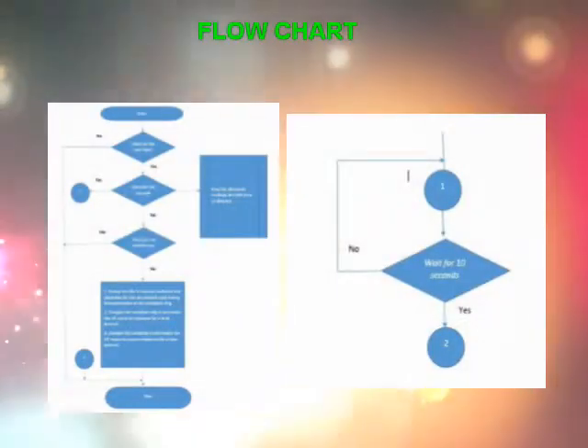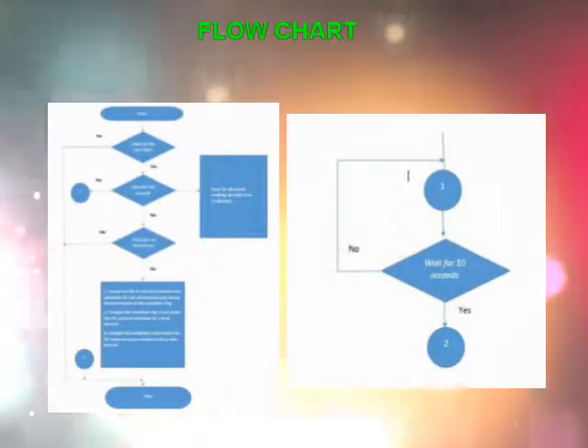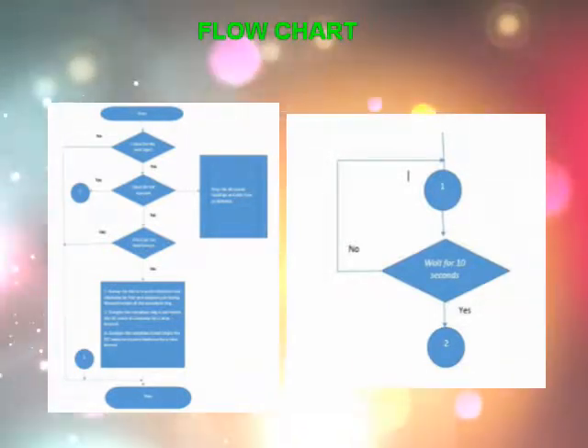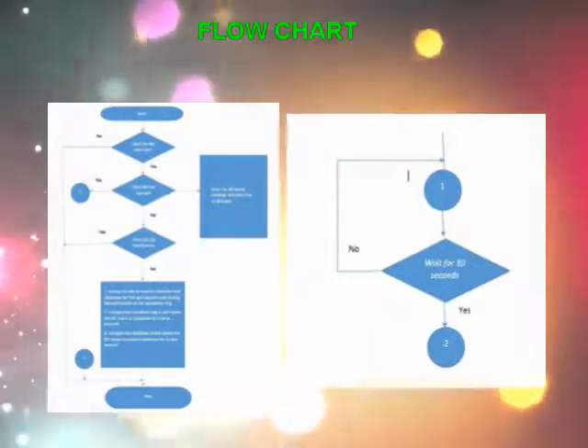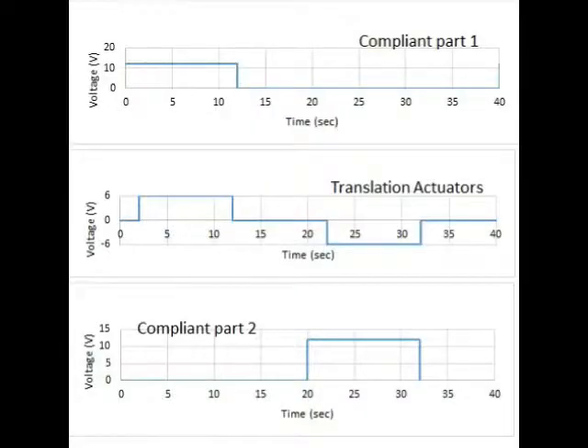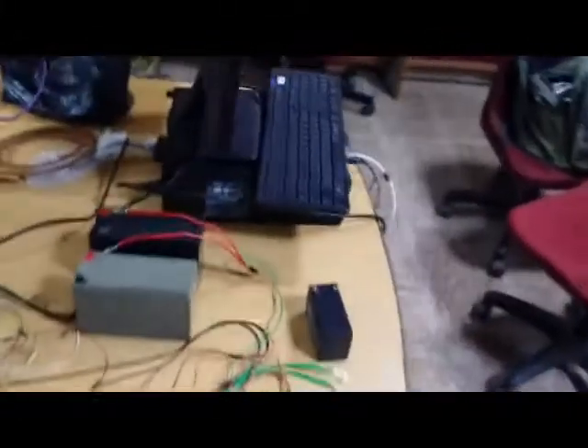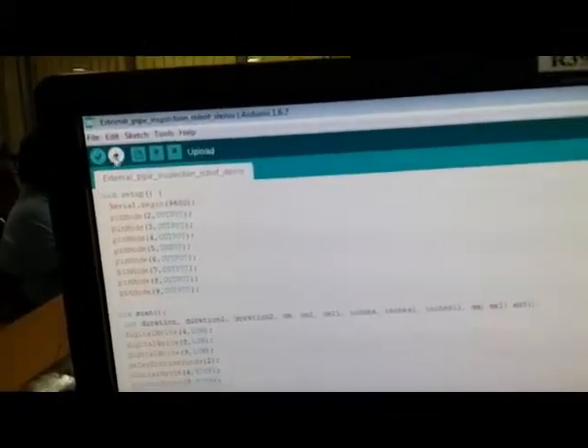Now in automatic mode operation of the robot, an ultrasonic sensor is used for surface detection and an infrared sensor for obstacle detection during inspection. An algorithm is developed based on the cycle time of the inspection, with intelligence controlling the locomotion of the robot based on the sensor values. The ultrasonic readings are saved for backup and analysis, and a graph is plotted for time vs. magnitude of the crack at each section of the pipe, and position of the robot over the pipe vs. magnitude.